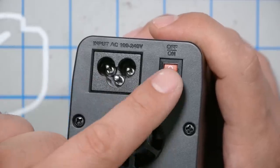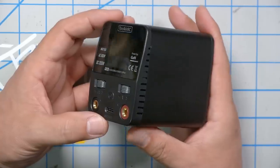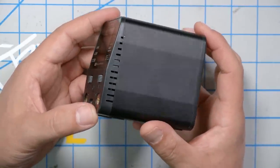This power supply can plug into the wall and comes with a power cord for whatever region you're in. It also has a mains on-off switch. Unlike many lab bench power supplies, it also has the ability to plug into an XT60, so in theory you could take this to the field and do everything I'm going to show you there as well. It's really small compared to many other power supplies of similar rating — a 100-watt rating on mains power or a 200-watt rating off a battery, with a 10-amp maximum and up to 30 volts output.